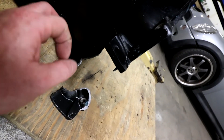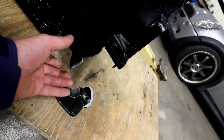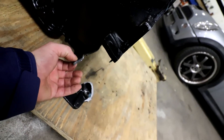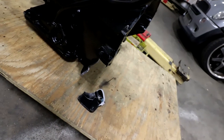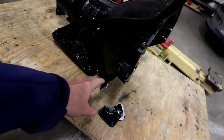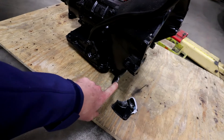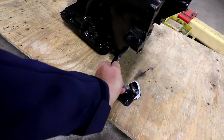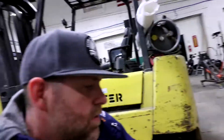Foot-pulsing allows me to control the puddle better — I can see when it's starting to flow out, because certain areas will be hotter and cooler depending on whether the casting is thick or thin. This piece seems to be thicker here than here, and really thick up top, so I may have to manually pulse more heat into the thicker areas and control my heat carefully in the thinner areas so I don't blow through.